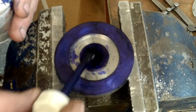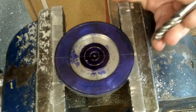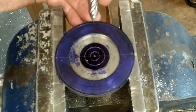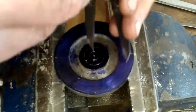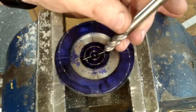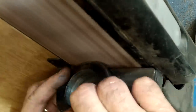I lightly pressed two spare bits of material into the blank for marking out purposes — it didn't have to be two bits, it just worked out that way. The two marked-out rings provide points of origin to mark out the cam arcs. As with the cams on the swivel block, the cam was marked out and then dot-punched along the intended scribe lines. It's worth noting that rapid stock removal to a scribed line will almost always burn the marking blue, destroying the scribed line — and that is why I use dot marks along the scribe lines. Once the scribed lines are laid, the temporary boss is removed. The excess material was ground out with an angle grinder before being finished on the belt sander.